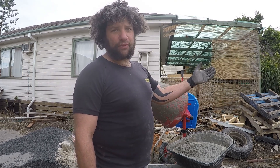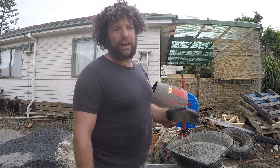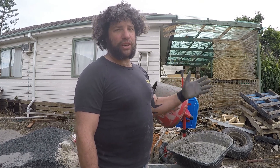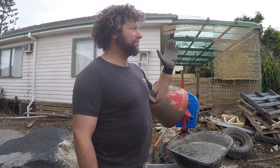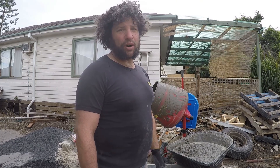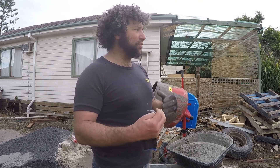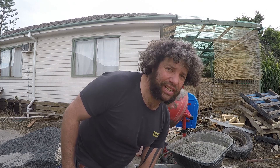The back of the wall, if you haven't seen the photos, is rubber membrane and there's also a builder's plastic put over it as well. We've given that three coats of rubber membrane and a tar paint, as well as the black plastic and the scoria. We've also run an agi drain along the bottom of it. So we're trying to keep as much of that moisture and water away, and if there is water or moisture against the wall, we want it to run away and get rid of that moisture as quickly as we can.